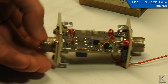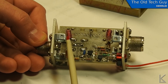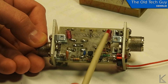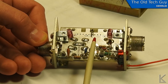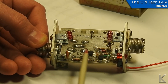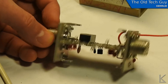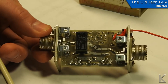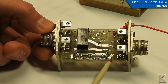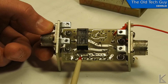So obviously what's going on here — we've got these little inductors. That's a small one, just a couple of turns. There's another one. There's a capacitor there. Some discrete electronics over here which is obviously for the switching. On the other side we've got two more little two-turn inductors and some capacitors.